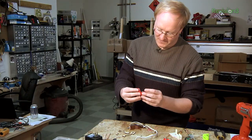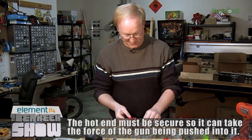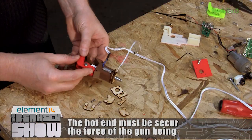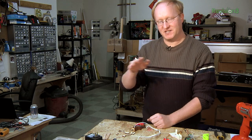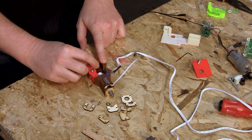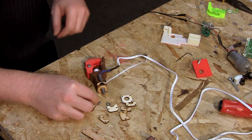This is the new arm that I printed — it has a little better opening for the glue stick, the bearing is still pretty much the same, and it's going to go right there. You shouldn't actually have to remove the arm; you should be able to put the glue sticks in one right after the other. But if you have to remove the arm, you can pull it this way — there's going to be a tension spring right here.